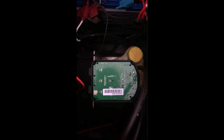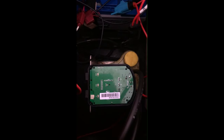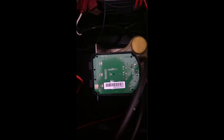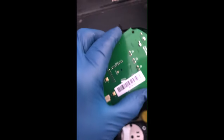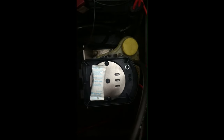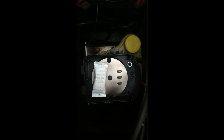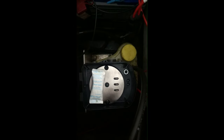Now I'm going to remove the silicone protectant over the top of the circuit board so you'll be able to see it. I'm going to pop the circuit board off and check it for any corrosion or condensation that's built up on top. To pop up the board, grab it on one side and lift until it pops right out — it has two long fingers on one side that hold it inside. There's your motherboard. Next, inspect and make sure there's no condensation inside the top of the motor. I have a moisture-absorbing packet on top of mine. I don't see any moisture, but I still think I have a faulty circuit board, so I'm going to call Power Pole.